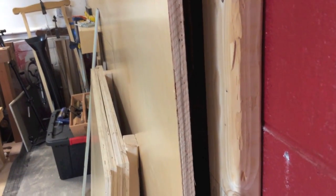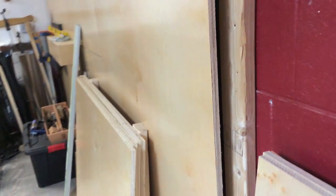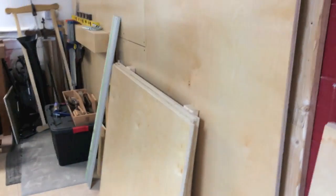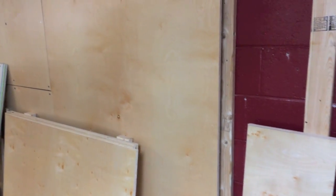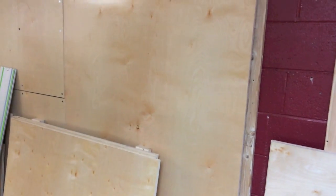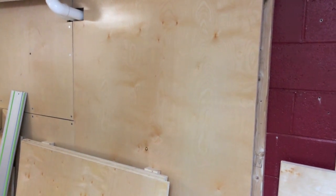Well, this panel, as you probably can see, is not attached and it's not flush to the wall because back inside there is a junction box that is too thick to go behind the panels. So I'm going to go with a special narrow junction box that fits behind 1.5 furring strips. Problem is there's a bunch of other stuff that needs to happen that needs to be moved over.